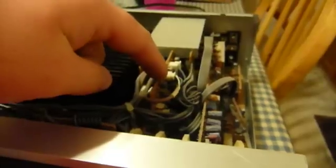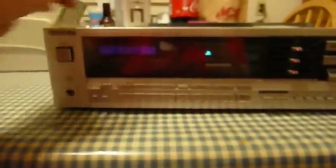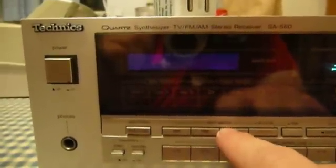There are a lot of circuit boards in here. This thing claims to feature the new computer drive system, and over here on the end is the tuner board. I think this is the computer drive board, but there is no computer drive monitor on the front panel — just no place to put it. What makes this receiver so special, and the reason I wanted one after seeing V. Westlife's demonstration, is that this thing is able to play TV audio. That's analog TV audio, and analog TV is now obsolete after the digital switchover. But if you have an RF modulator that still modulates to the NTSC standard — and there are stereo modulators available — you could play your TV audio into this thing.